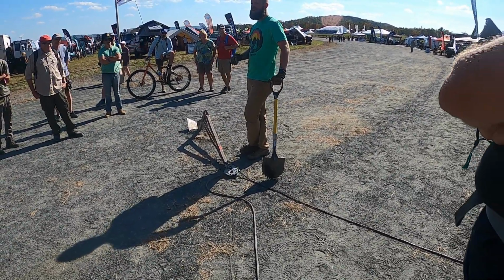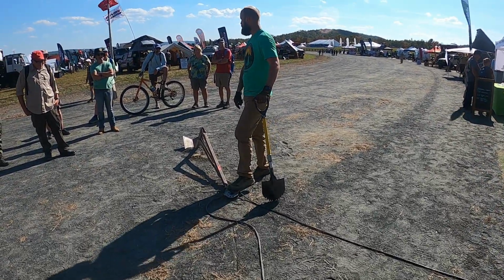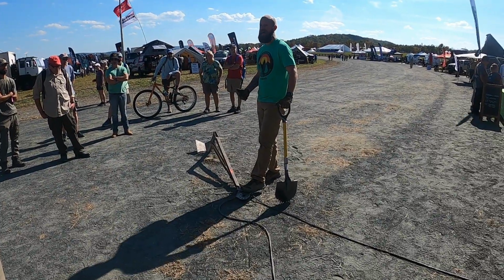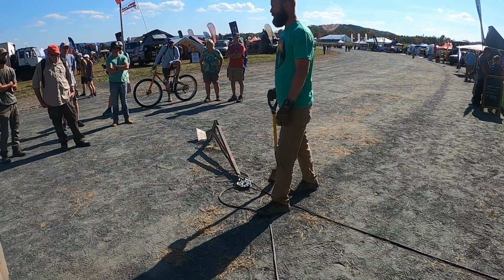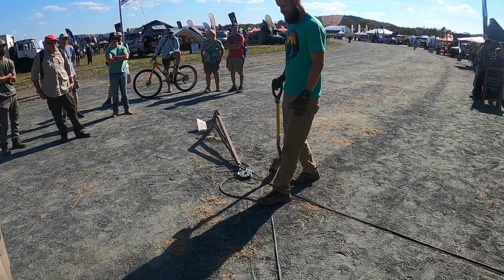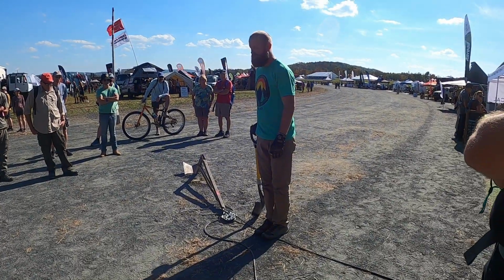Now that that's connected, this is considered a live recovery, right? This line now could go tight because the hook will not pass through my pulley. So we consider this a live line. All live lines, when we cross them, we step on them, not over them, because that could be a bad situation, right? My name's not Michael anymore, it's Michelle. So step on them when you cross them.